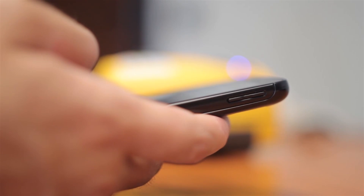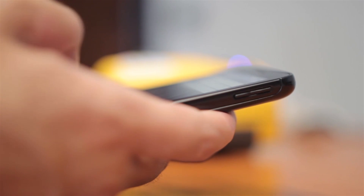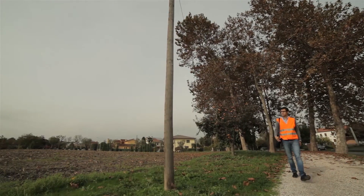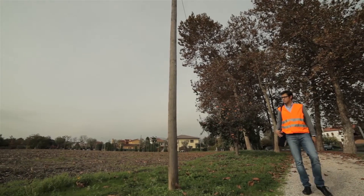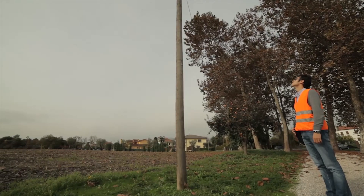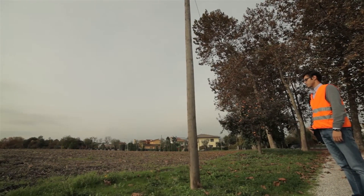The CXI-PT5000 device uses innovative analysis techniques to measure the strength of wooden utility poles typically used in the telecom and electricity sectors. Using patented technology, the device is used to report the Ultimate Breaking Strength of a pole. By UBS we mean an objective measurement of the overall strength of the pole, including below ground.